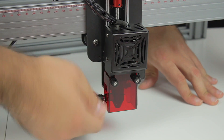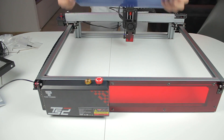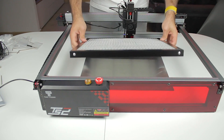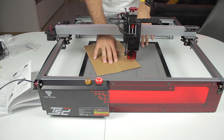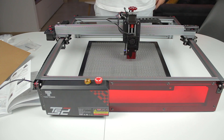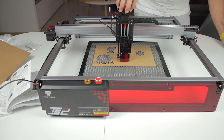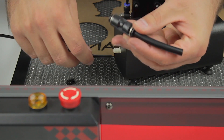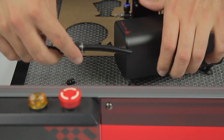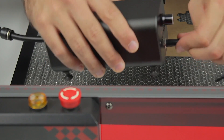Next I'm going to install the connections for the air pump at the laser nozzle. The laser itself is completely assembled. We'll now install all the accessories from the beginning of the video before the first tests. Starting with the honeycomb, we install the protective sheet at the bottom and the honeycomb mesh on top. We can't use the provided materials because of shipping damage, so I'll use materials from the other 2Trees laser engraver. We connect the air pump: the air pipe is already installed in the TS2 laser, so we pick up the pipe adapter and connect it to both the pipe from the machine and the air pump. We also connect the power from the front.